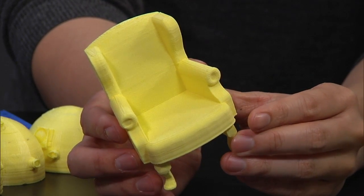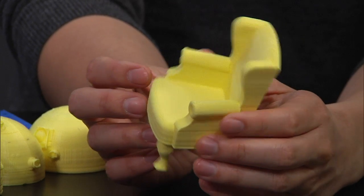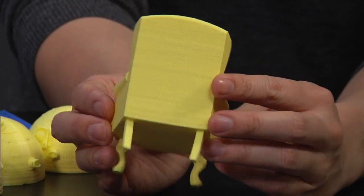And then they can warp on the bottom and just shrink differently. A lot of these problems are interrelated. For example, if your build plate isn't level or it's too close to the print surface, then there won't be enough room for the plastic to squeeze out, and that'll cause the filament to strip, and then plastic will stop coming out, and you end up in a situation where something stopped working. It's the same exact symptoms, but there's 15 different causes for it potentially, and it's really hard to troubleshoot, especially if you don't have experience with it.